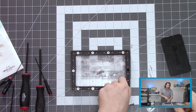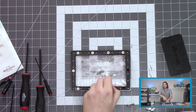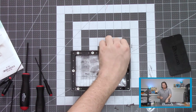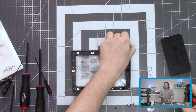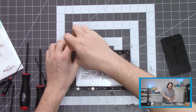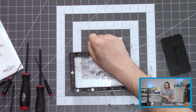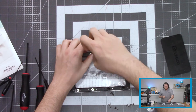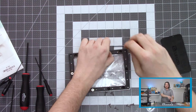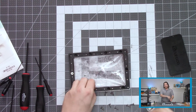Now do note, when you're in here there might be some liquid resin. So it is recommended that once you get these first few screws out, go ahead and put on a pair of gloves. You can cure it all day long, but if you did get a break in your FEP, it's likely that somewhere along this line you've got some raw resin hanging out. Take precautions. I recommend that you have some spare tanks — they're crazy useful if one fails. You can easily pour your resin into the new tank and continue printing, put the failed one off to the side, and deal with it on a later date.